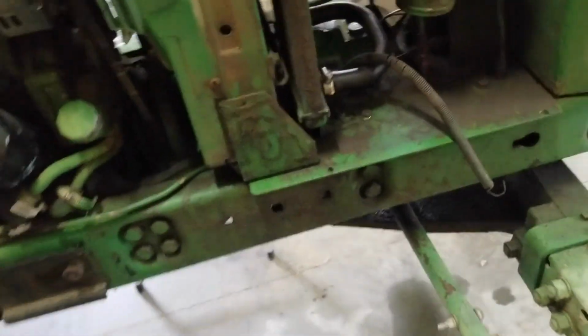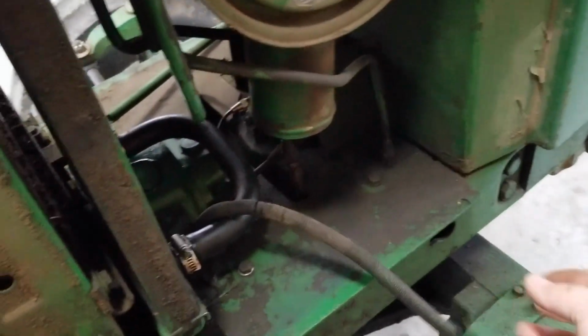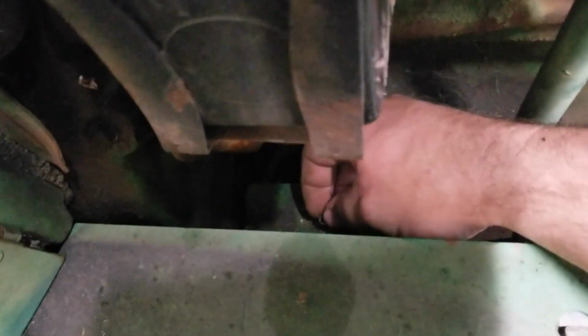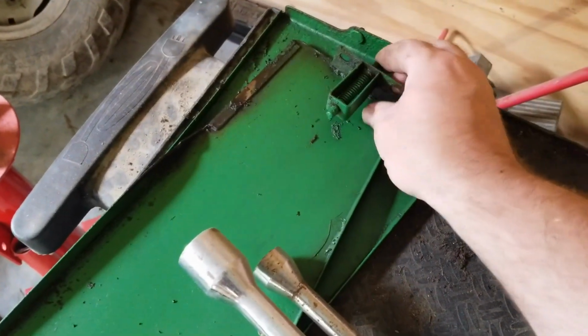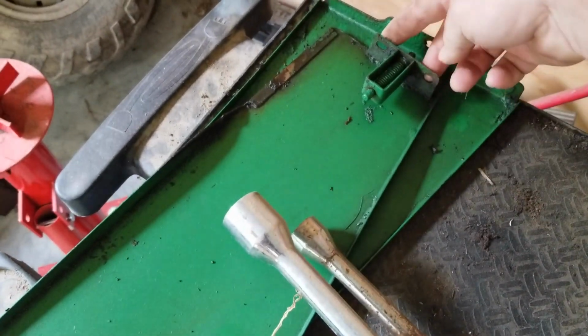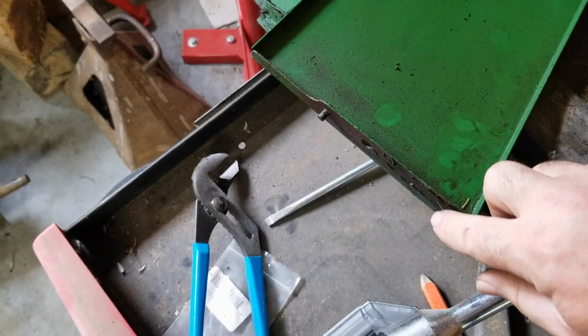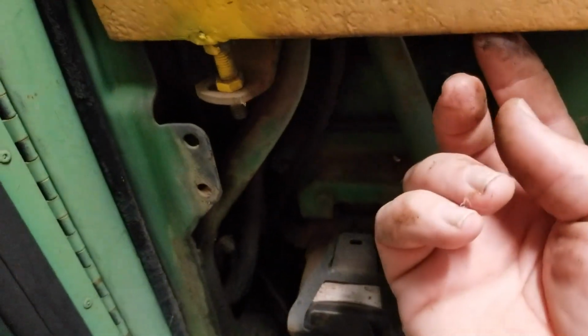The screens, the spring hooks in the top. There's a pin on the bottom that goes in these holes, and it just flops in, and the spring holds the top in. The cowl panels, there are these two pins down here that you line up with the bottom here. See, this is a little spring pin. So you get the holes, the roll pins through those holes, you push down on it, and this is going to push against you. And then you slide the top in, and then there are these two pins that match up under here. They're holes.